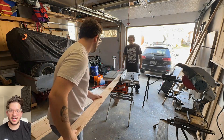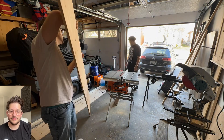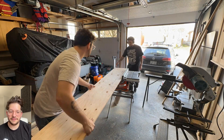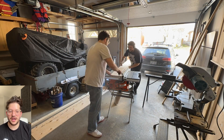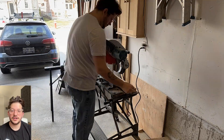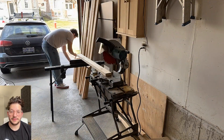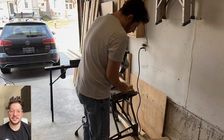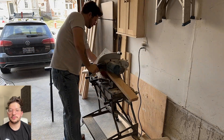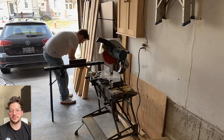Now I'm using my table saw to cut my bracing, and I'm doing my braces at three inches wide. I'm cutting the remainder of the five-eighths inch plywood on my table saw to three inches wide, and then I cut those braces to an inch and a quarter short of two feet because these braces will fit on the interior of the frame. We subtract that inch and a quarter because that is the width of two five-eighths inch pieces of plywood.